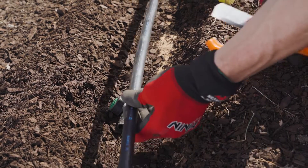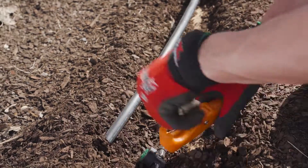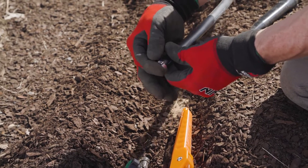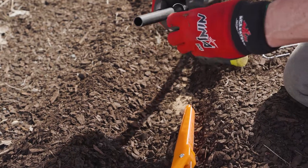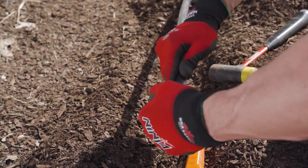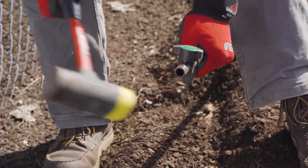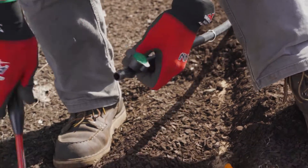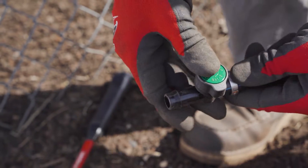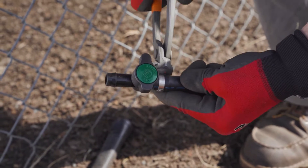We're going to take and cut the pipe — just put it down in the cradle there and rock that cutter and it'll cut right through it like that. Keep it out of the dirt. Then we'll put on our clamp and make sure we have it the way we want it. Slide it onto the pipe, give it a little tap so it goes on easier. There you can see it went on all the way right to where we want it. Slide that clamp down right about there.